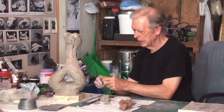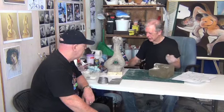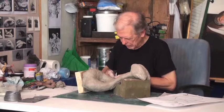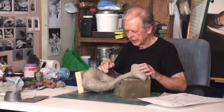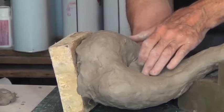Okay. So what I do then is I've got an old sponge that I keep from packaging. And all I do is I just turn it like this. I just lay it down like that. And that forms my sort of bowl, with all the shims around here like this. To make that center there, I take a bit of clay like this, and then I just block that off like that. Smooth it out. This clay I take out when I do the other side. Oh, because you don't need it anymore. Yeah, I don't need it anymore.